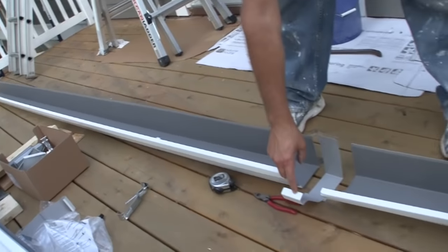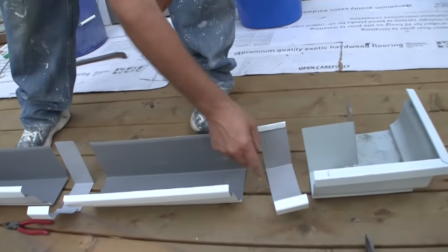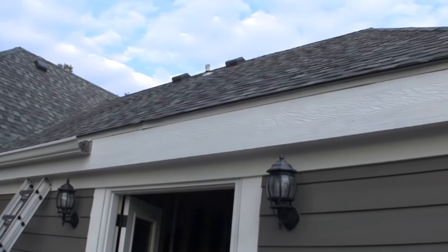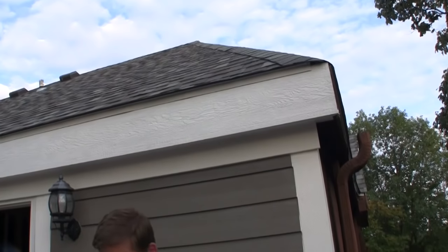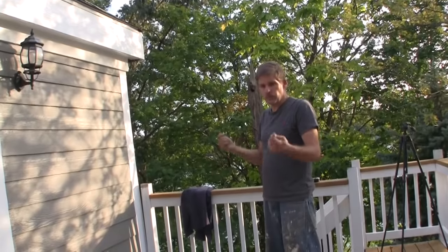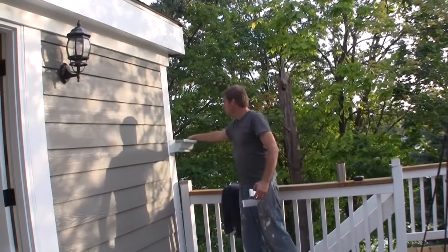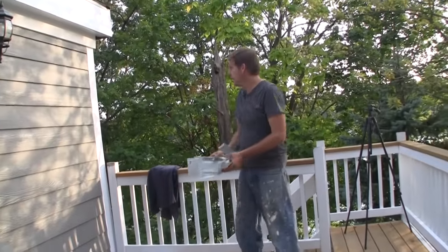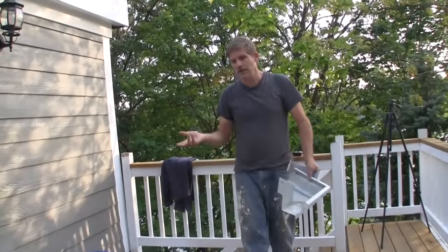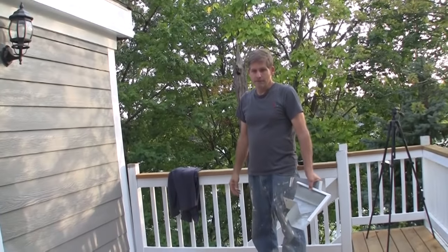Because they're aluminum, it's like an aluminum can — they're pretty bendy. So you can just put them back into shape and you're good to go. Our final look is going to be our outside corner with a seamer, this piece, and another seamer — that's how it's all going to come together. That's our perfect length for the gutter to go around the corner. So you've got a gutter, a seamer in which both gutters come in the middle and we'll screw that on, another piece of gutter, and then your final outside corner piece. Every place you have a seam you need a seamer. Once you do one section of guttering, it's the same process — just repeat it over and over. If the house bent the other way, you would buy a piece called an inside corner. But this is not at all difficult — just repeating the same process, putting your appropriate hangers in the gutter, hanging the gutter with an appropriate slope. Any homeowner can do it.